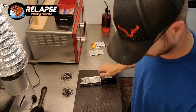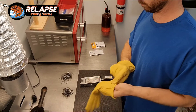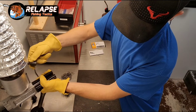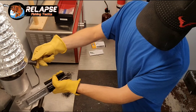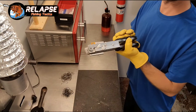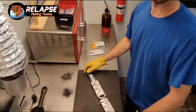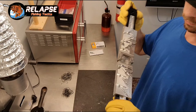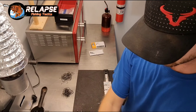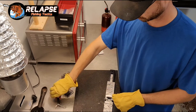I forgot to put my gloves on here. I was going to pour in the spot without the hooks just to help heat up the mold a little bit more, but I ended up saying the heck with it and pouring right away anyway, because that would not be enough to heat the hooks. The mold was still not hot enough and did not pour all the way. So I'm going to pop these out of there and do some dry runs without any hooks in them.